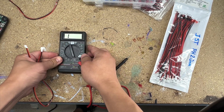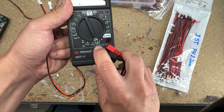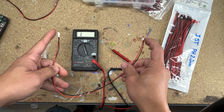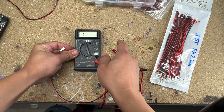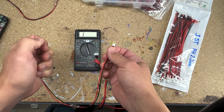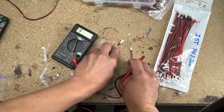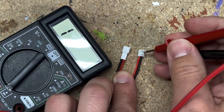If you have one on hand, you can use a multimeter or circuit tester to test for continuity — essentially just verifying that the wire is connected from one end to the other. Turn your multimeter to the icon that looks like an arrow next to a plus sign or a Wi-Fi symbol. If they're connected, it'll show the resistance. A reading of '1' means 100% resistance — nothing connected. Zero or below one means they are connected. For a straight-through wire, you should expect zero resistance.